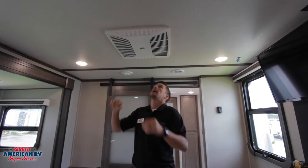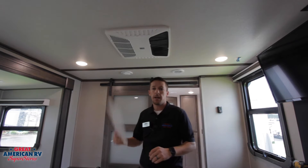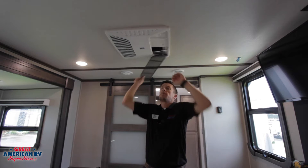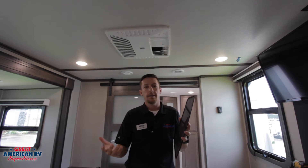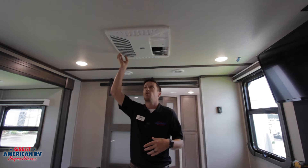Let's go over a little bit of maintenance. Maintenance is required pretty regularly when it comes to these vents right here. If you pull these off, you can get access to your return air vents — it's just a little screen. This screen can be cleaned off with an air compressor blower or a damp cloth. If you have animals, you're going to want to clean that quite regularly because it's really good at picking up dog hair and cat hair. So we want to clean both of those filters on a regular basis.